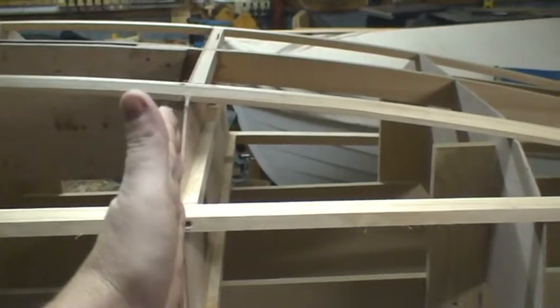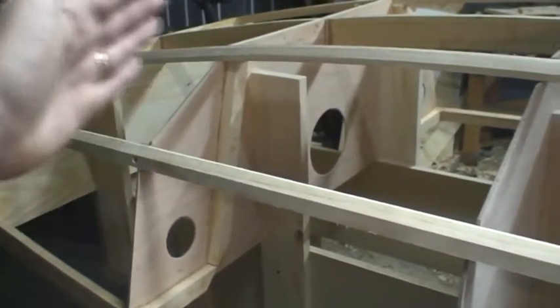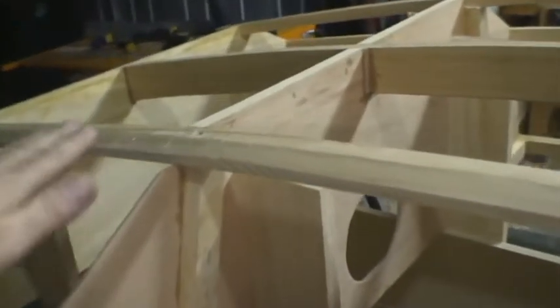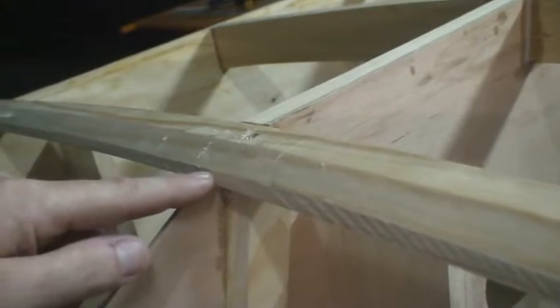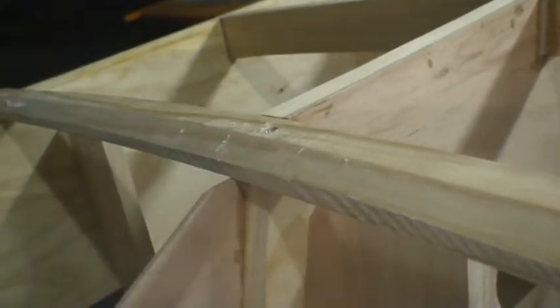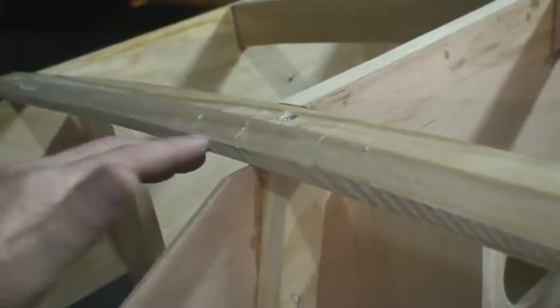Chines are glued on now. Remember that this boat has two buoyancy compartments: the first is forward of station 2 up to the bow, and the second runs down the side of the cockpit and behind station 4 at the back end of the cockpit. When we cut these chines in, we end up with what's called a limber hole — quite a natural limber hole. This is an area where any water inside can easily drain from the side of the cockpit into behind the cockpit, from which you can then get the water out.